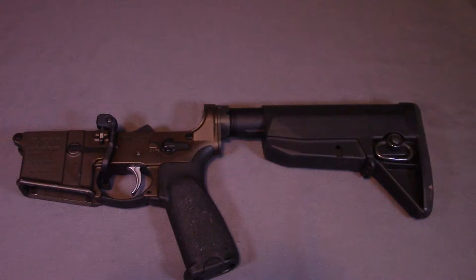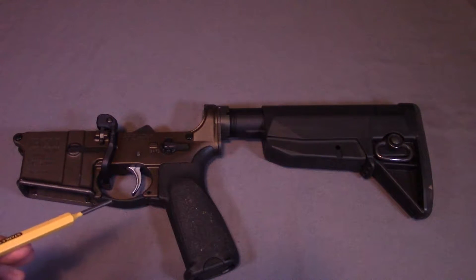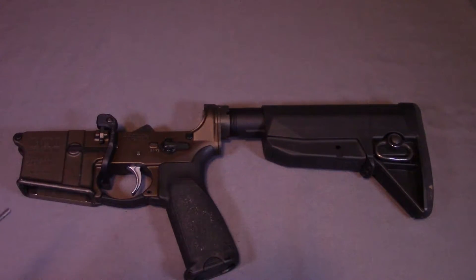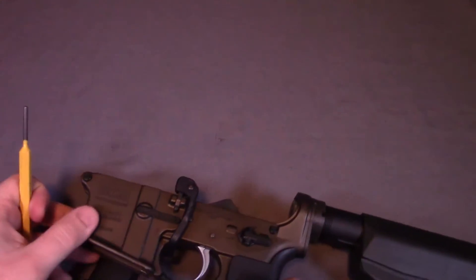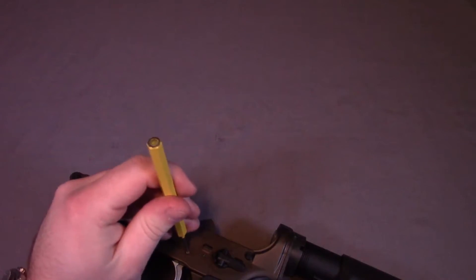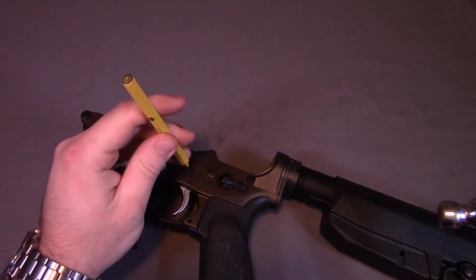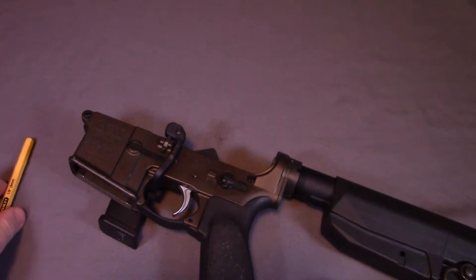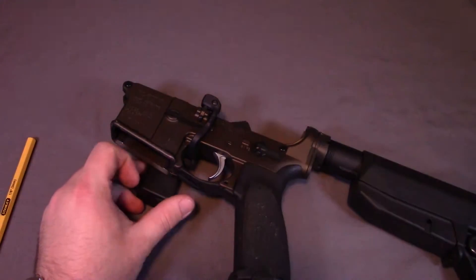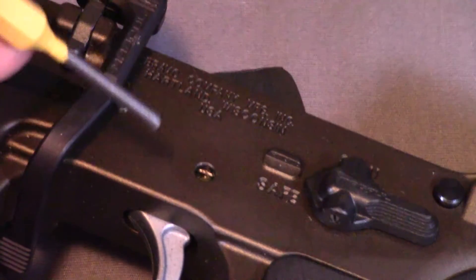The way I'm going to start is basically knocking out the trigger pin. I'm going to use this punch to get that trigger pin started and then force the new pin in behind it, just creating a little space to work with. I'm going to take a little Glock 26 mag here just so I have some space underneath it, and give this thing a nice gentle tap to just get that pin started.